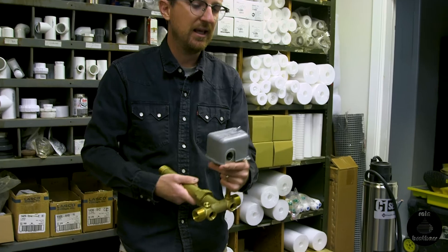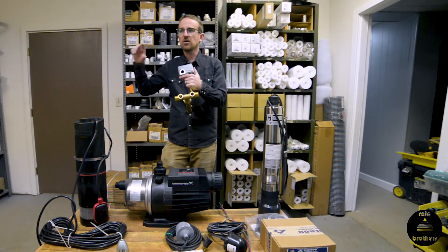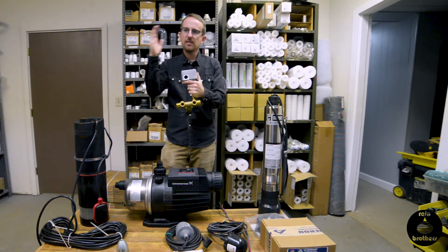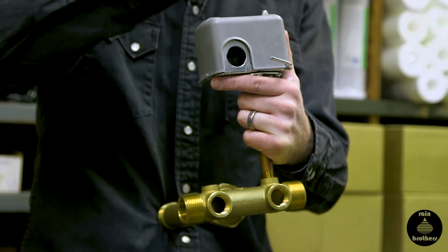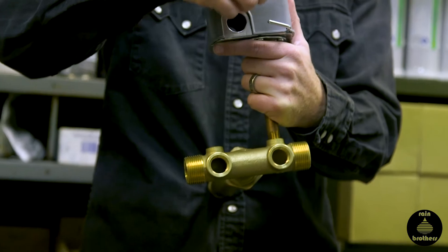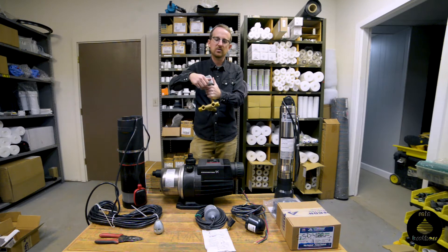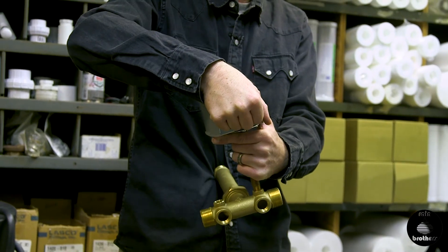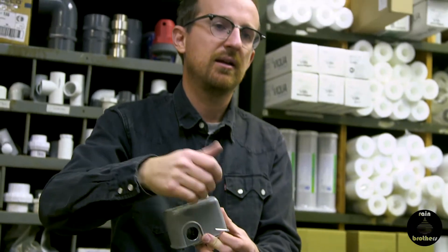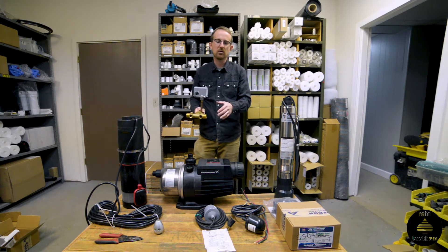The downside is that if you have a sudden surge in water usage — like turning on three showers at once — sometimes the water pressure dips quickly below the cutoff pressure mark for this switch, and all your household pressure drops. In that case, you have to go down, find your pressure switch, pull this lever up until your water pressure builds again, and kick the water back on. But it is a good method — with this in place you will never burn out your pump motor from running dry, as long as the pressure switch is working.